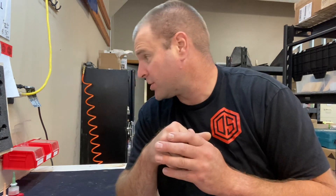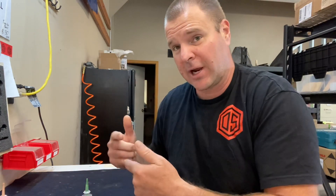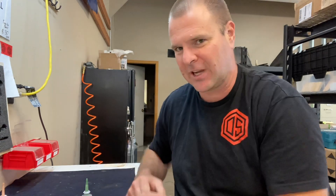The 'ask me why I know this' part of the story: I was setting up Mercs at this exact bench. We use red on the gas tube to size it precisely for every gun — that's what this castle nut is for. We do that before applying the bearing compound and the blue for the screw threads. I'd set it up but hadn't reefed it down yet — just loose, wet-fitted all the parts — then I got interrupted. I came back five minutes later and it was a brick. So keep that in mind.